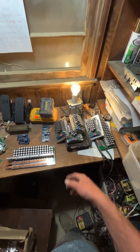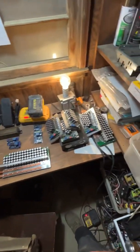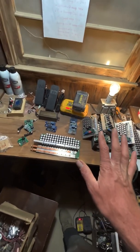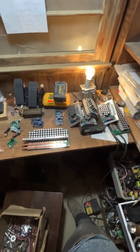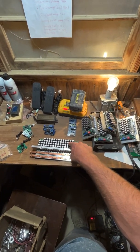I may just end up using those for something else. That's the controller overview. I kind of steer away from the golf cart controllers just because I like the ability to go up to 200 volt, and that's a lot easier to do nowadays with lithium and series smaller cells.